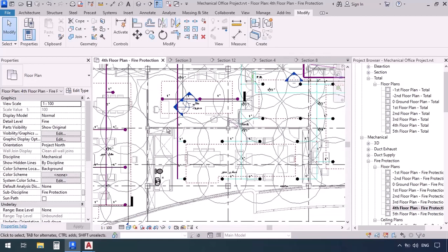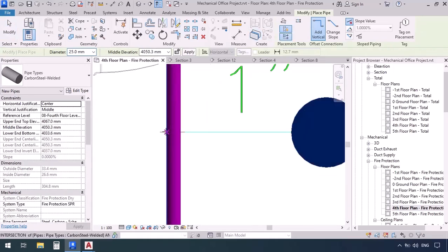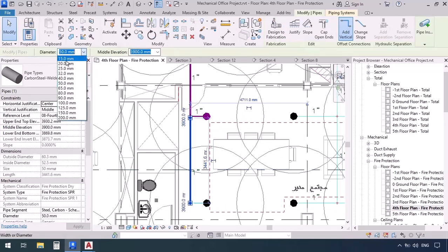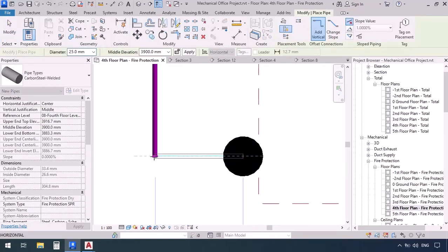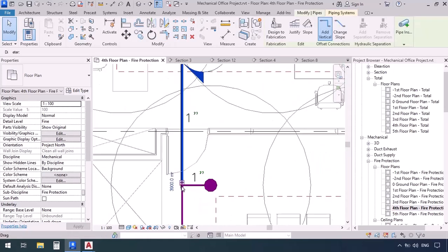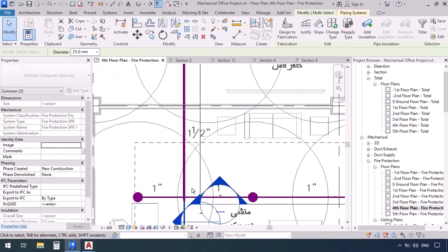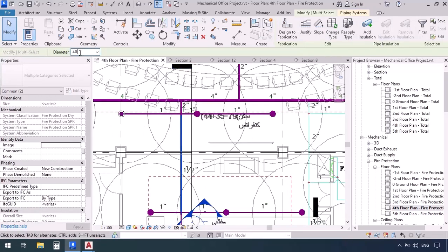Now let's go back to the plan. We're going to try to connect these two sprinklers by PI. Because we're connecting from the side of the pipe, we use inherit elevation, then click here and click again to connect to the sprinkler. Now let's change the diameter of this pipe to 25. Then try to connect it to the sprinkler — pipe command PI, then add elevation 3900. Click and click again here. If they didn't connect, we use trim TR and connect them together. Let's also double-check the sizes — this one is 1 inch. I'll select the pipe and the T, then change their diameters to 25, which is 1 inch. Then let's go higher — this one is 1½, so let's select the T and the pipe by holding the CTRL key, then change their diameters to 1½, or 40 millimeters. Also, the start of the line's diameter was 2 inches.